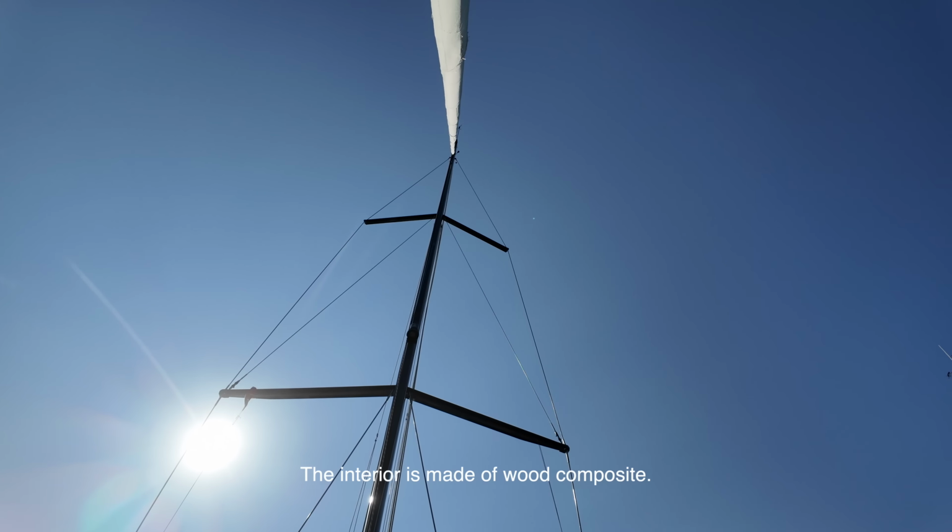We're using four of these rolls of 450 gram on the inside of the hull, even a bit more since we're laminating a bit thicker around the keel area. And then roughly the same amount on the outside, but with 600 gram. And then on top of that, we have roughly the same amount of epoxy. So for one roll of this, 50 kilos, we're using a bit less than 50 kilos of epoxy, maybe 45 kilos. That's why we buy epoxy by the drum.